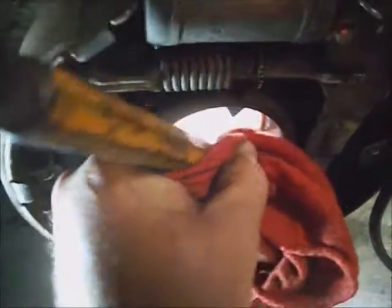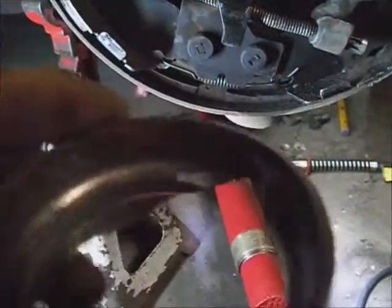I don't even know where the piece of chisel went, but I use this heavy leather welding glove. I packed it full with shop towels and hit it about three times and it fractured. I don't think that bearing will put up much of a fight with what's left of it — it'll come right on out. I had to put the puller on it and pull it out; it was hateful all the way to the end but at least it was moving. Not too bad — little scratch here from the cutoff tool, none in the back where I was working, little chisel punch marks. It's cool.